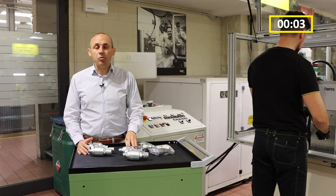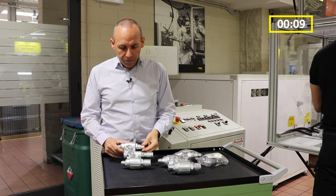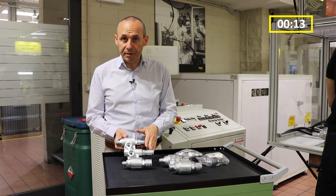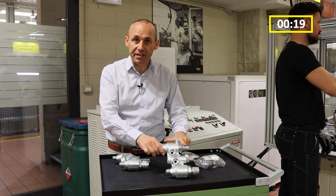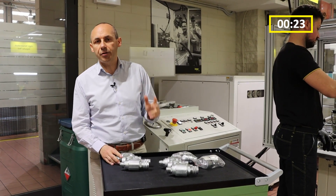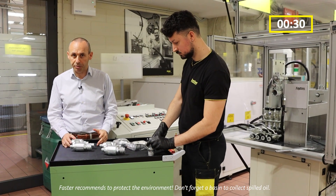This product was launched in production over 10 years ago, offering a couple of main upgrades with respect to the previous series: mainly a better performing surface treatment on cartridges — zinc nickel instead of chrome 3 — and higher robustness, as witnessed by a remarkable increase of maximum operating pressure.